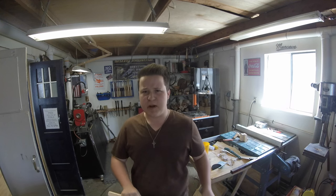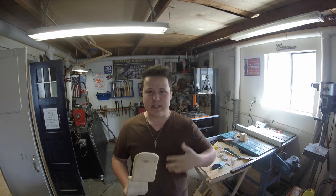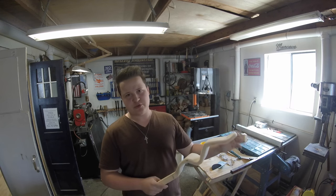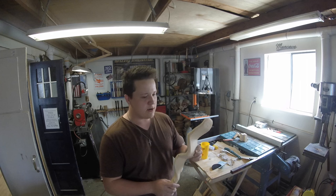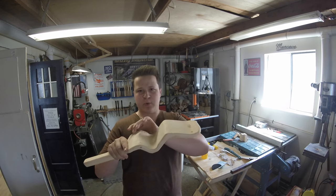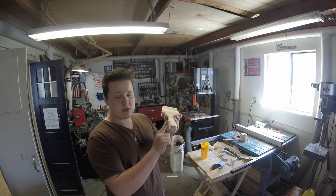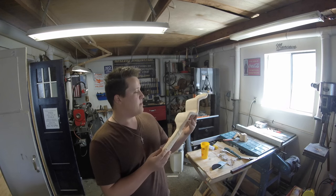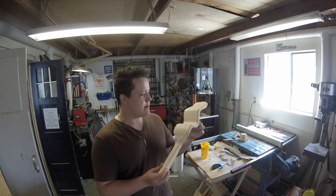The second one is just three two-by-fours laminated together. I used two-by-fours because it's very soft wood and easy to work with. I was very careful while sanding to make sure all tool marks, bumps, and ridges are out. I also added a 3/8-inch round-over on every edge and used my table saw to shape the handle instead of free-handing it on the bandsaw.